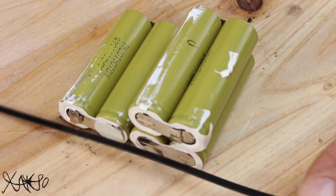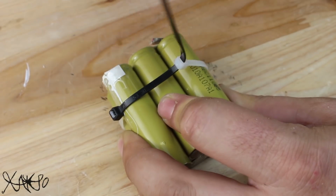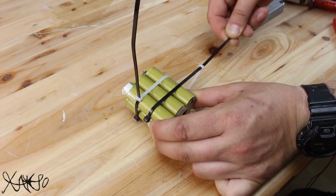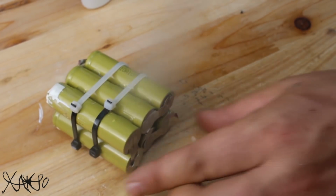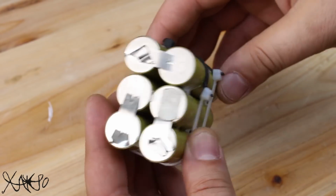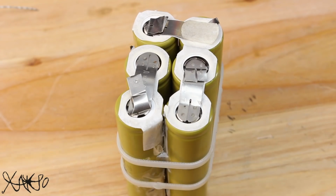My laptop battery was in good condition, so I got 6 lithium-ion batteries with 2000 mAh current capacity each of them, so all 6 will make 12,000 mAh portable power with 3.7 volts, all batteries connected in parallel, remember that.